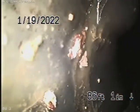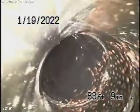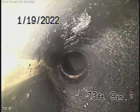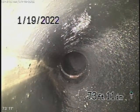It's nice and clean. As it comes onto the property, it changes to a section of ABS plastic — you can see this is in good condition. As it comes back, around about here you can see how the pipe starts to dive. The reason I'm pointing this out is because there is a clay pipe running through the driveway that doesn't look like it has proper grade to it. So here you have ABS plastic going down at a very good grade.